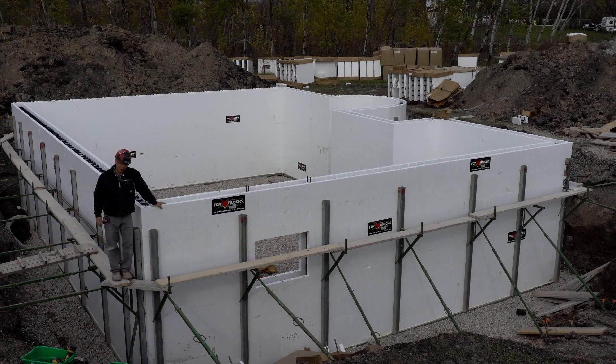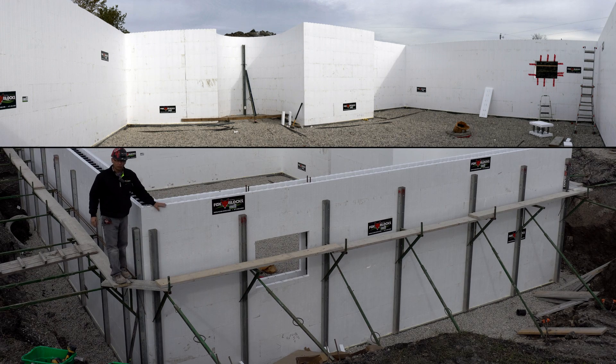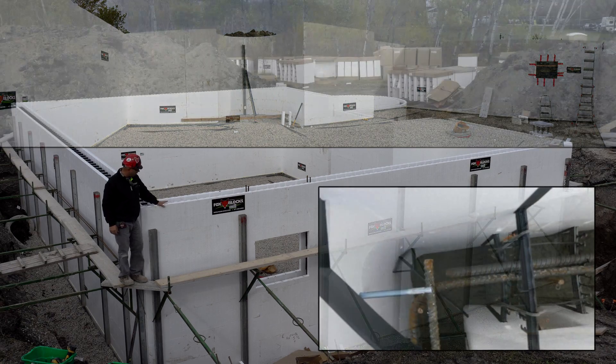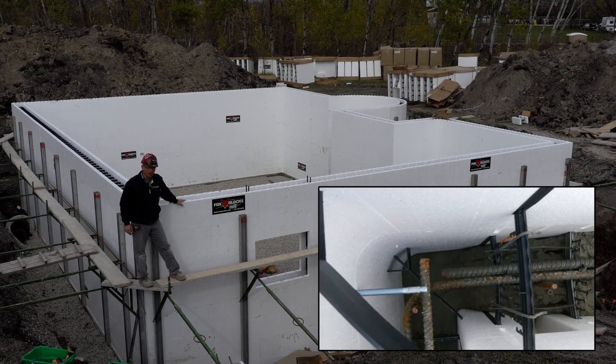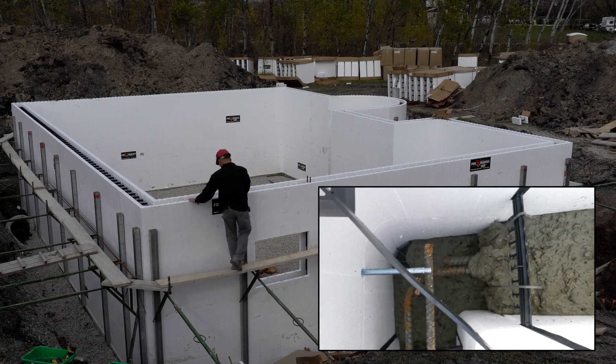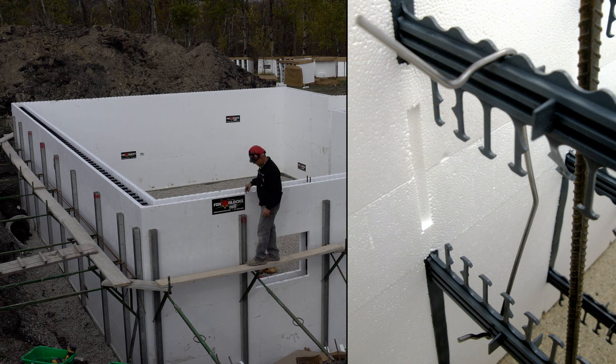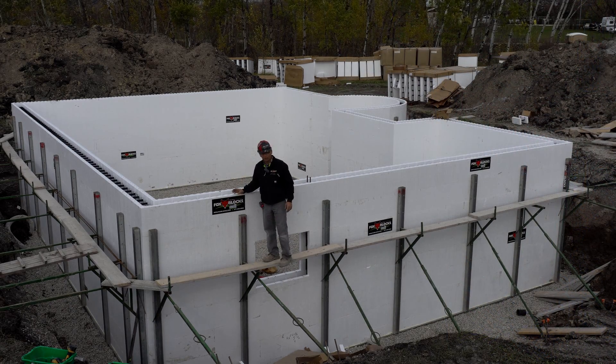They've got to the top row now — they're going ten foot exactly off the bottom, so that's seven and a half rows. They did the bottom row split in half, using the eight-inch piece. They could use both pieces because it's reversible block. They did that on the bottom row because we need the interlock on the top so we can continue up — we're going another two floors higher. On this top row, since it's the top of this pour, we clipped on. Wherever there's a joint we go to the second tie on either side and clip with vertical clips, clamping this top row down to the row below. That's important because a wet load of concrete will want to roll up and pop that top row off.